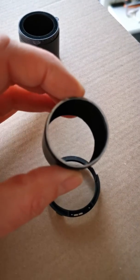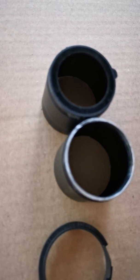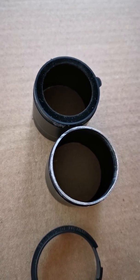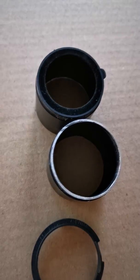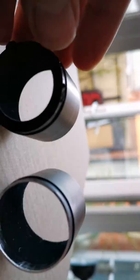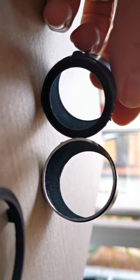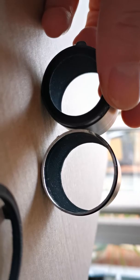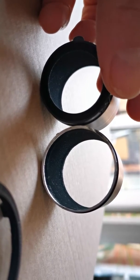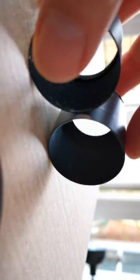So I've got another one, and this one is a bit shiny at the end because it should look like this — but instead what I've done — let me put them side by side so you can see. This lip here that you can see has just been ground out with a standard metal file.